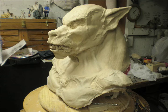When you get into more complicated mold making, like three-piece molds, you definitely want to design with this in mind, sometimes before you start sculpting. The main problem that we had was that we had to secure these ears. I didn't want to take them off. A lot of times you'll find that mask makers will remove things like that and create a crease in the sculpture so that when you put the ears on the finished product, it looks natural, and there's nothing wrong with that.